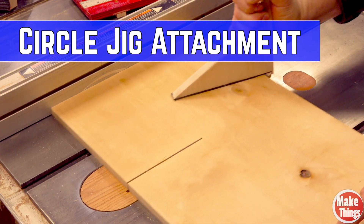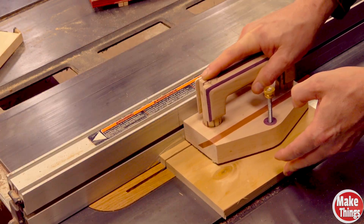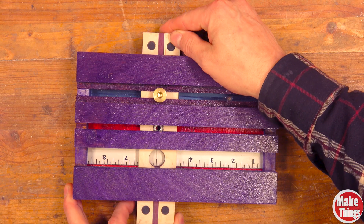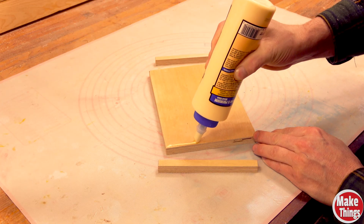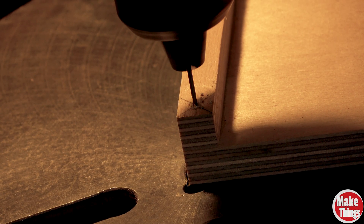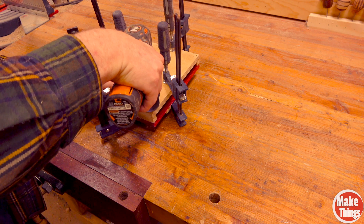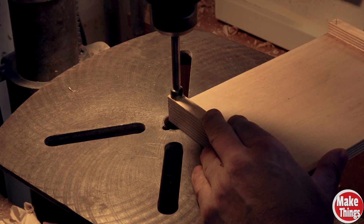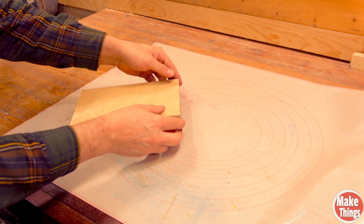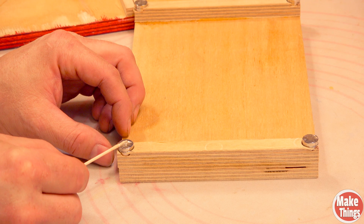The circle jig attachment is the same size as the base. I cut two strips of half-inch plywood from the scraps — these will act as spacers and runners that will allow the vertical miter arm to slide below it. They're six inches in length and glued parallel to each other on the edge. The base and the jig will both use rare earth magnets. I drilled a point of reference that I transferred onto the base, then drilled eight holes that will fit eight magnets. I first attached each set together, added epoxy, and then the jig. Once one side was epoxied, I pulled the back off, added epoxy again, and clamped them together.